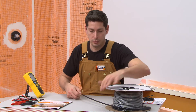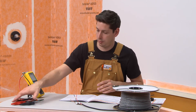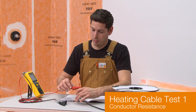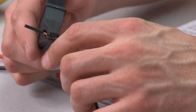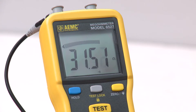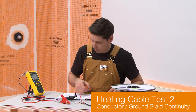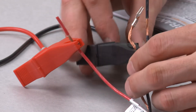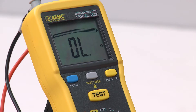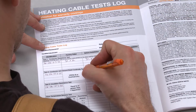The first series of tests is performed before removing the cable from the spool. If a break or damage is detected, return the heating cable to the original place of purchase. Test one is to check the heating cable conductor resistance — this test is required for warranty coverage. Connect an ohmmeter or multimeter to the heating cable power leads to determine the conductor resistance. Verify that the measured resistance is within 10% of the factory resistance value printed on the spool, and record the factory value and reading in the log. Test two is to check for continuity between the heating cable conductor and ground braid — also required for warranty coverage. Connect an ohmmeter or multimeter to one of the power leads and the ground braid. In a successful test, the meter will display an I for infinity or OL for overload, meaning the conductor is not touching the ground braid. Record the reading in the log.